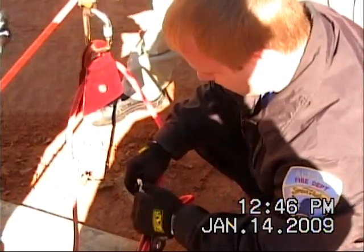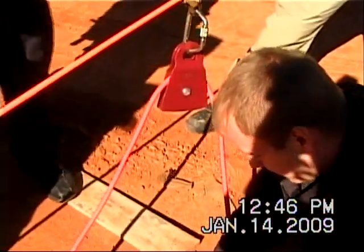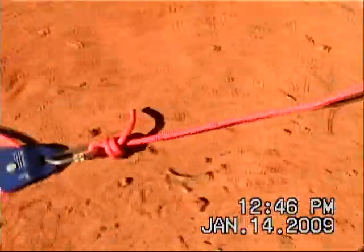You undid that. You flipped your pulley over. Alright, so this is the one we'll point out. You got your double-J. Here's your dead end. There's a J, and here's a J. So you come in — that's two. A moving pulley counts as two all the time. So you got two dropping off at that, two dropping off at that. You got two moving pulleys.